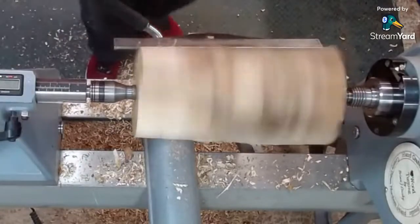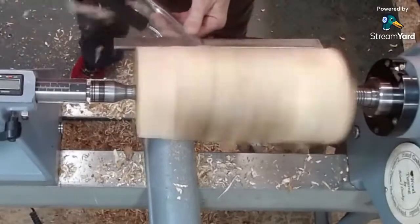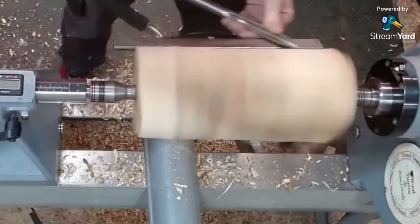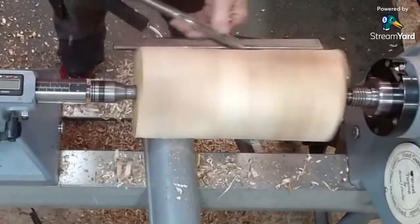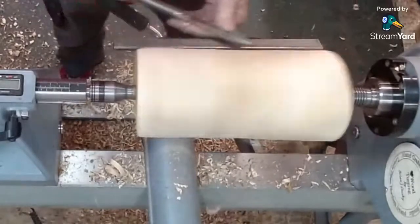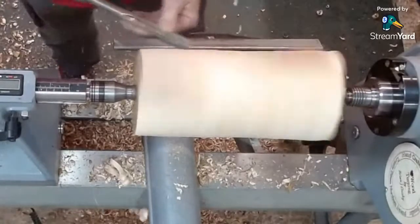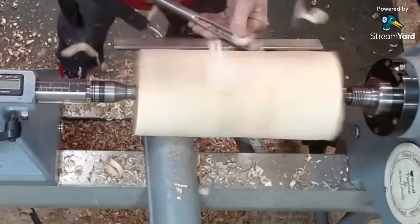The idea, Joe, is if you imagine when you cut a log, you've got two open ends, two new ends, and the moisture wants to escape. It'll take the easiest route, and the easiest route is the open ends. If you seal those ends, it slows down the drying process, and it reduces significantly the chance of major cracking. It doesn't eliminate it, just reduces it. So instead of the two ends drying fast and the sides drying slowly, the whole thing should dry at the same speed.